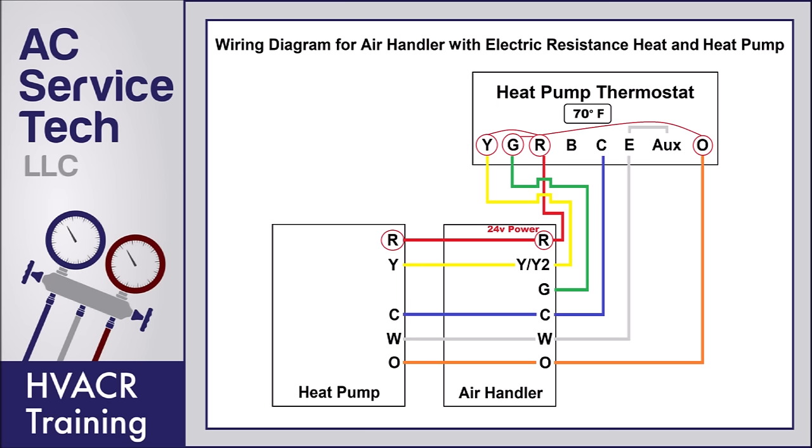If we're going to turn the air conditioning on at the heat pump thermostat, R is going to send 24 volts over to the G, Y, and O terminals. That 24 volts is then going to be seen at the air handler control board on the Y, G, and O terminals, and then it's going to continue out to the outdoor heat pump on the Y terminal and the reversing valve O terminal. This turns on the outdoor heat pump in air conditioning mode, controlling the compressor and reversing valve. The indoor air handler also sees 24 volts on the G terminal to turn the blower on, and the Y terminal determines the cooling fan speed.